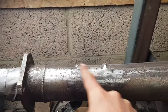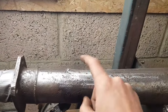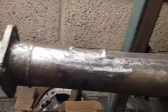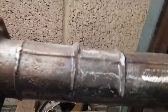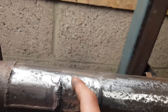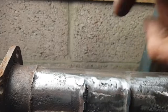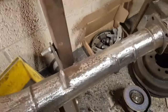Just finished welding these and began to dress the welds. Probably need a little bit more dressing down, but they're solid now and not full of holes. I'm just going to check it with a torch from inside to make sure there are no more holes. Still a few little bits to dress down a little nicer, but it's actually solid. I'll check it from the inside and see if anything is coming out — on this side as well.